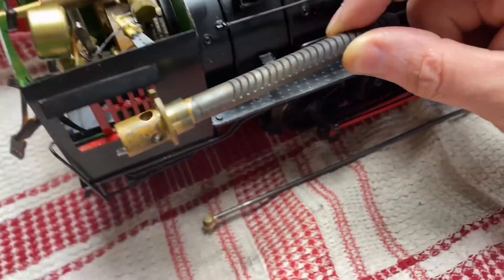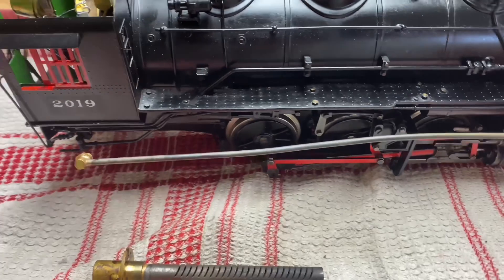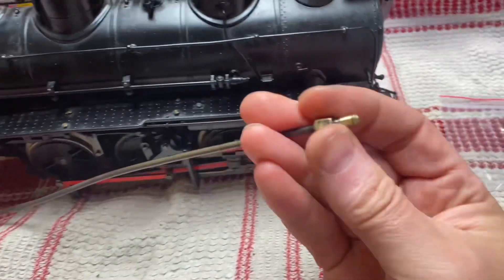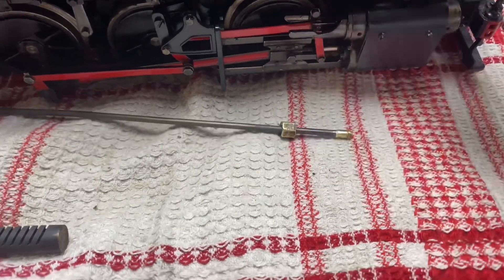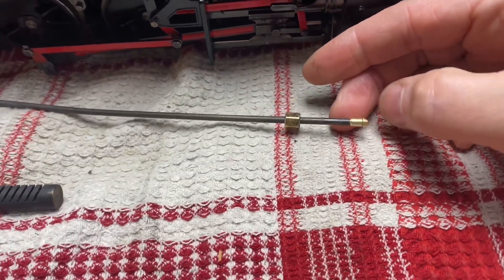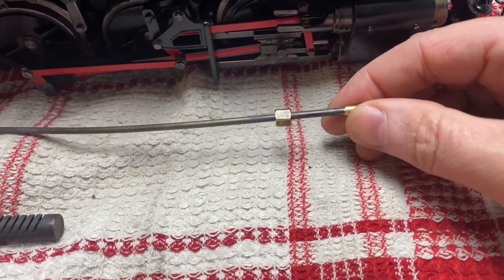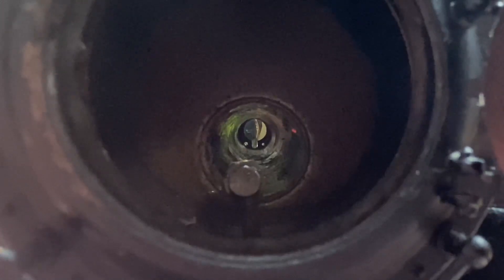But in this case it was a rather major failure. This is the burner that goes in the flue of the locomotive, down through the flue. This is the steam pipe — it's stainless steel with brass ends, the brass nipple on the end held on with this. The last time I ran on my friend Keith's garden railway, we started having problems: steam leaking out everywhere, spitting stuff back into the flue, occasionally putting the fire out, and then all of a sudden it went 'push' — the nipple on the end had completely given up.